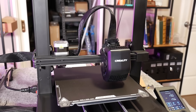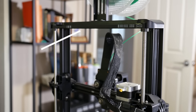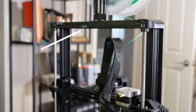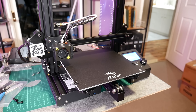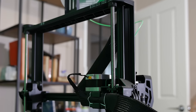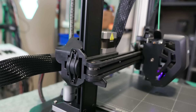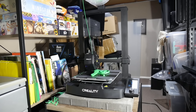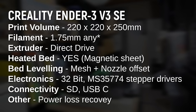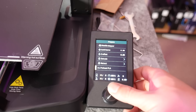Like the original it only has one stepper motor for the z-axis, but it uses a belt at the top to rotate two lead screws, keeping them in sync so the gantry won't go out of square — which was sometimes an issue on the original Ender 3 where the gantry could sag. These vertical V-roller extrusions look like a fully custom part, which is a big hint at the production capability Creality has these days.